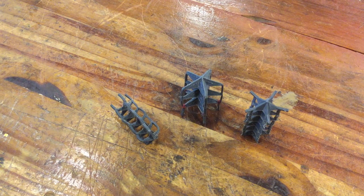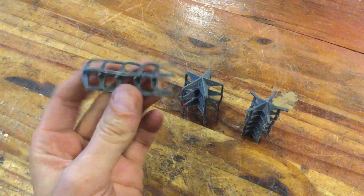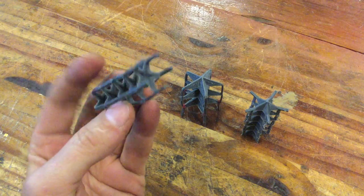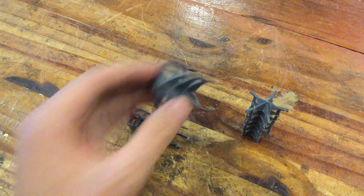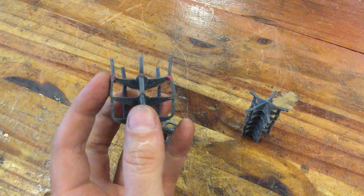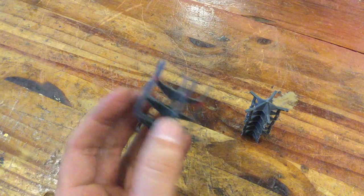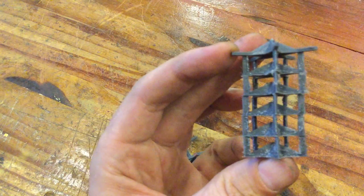We're going to talk about sprueing methods for 3D printed parts. There are a couple of ways you can design your parts to come pre-sprued. Most of these components were printed flat and then thermally bent over to make the sprue tree. You can see PLA to PLA fusion, and PLA to PLA with wax as a joiner, just to show different methods of assembly. Or you can design your part to print in a stackable configuration.